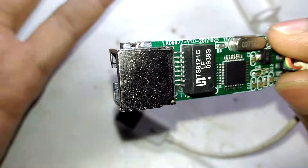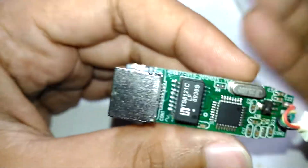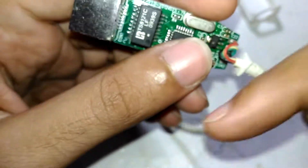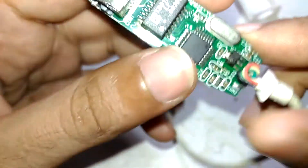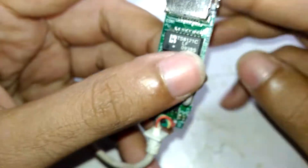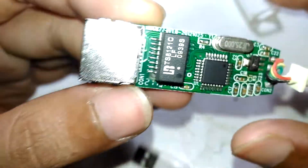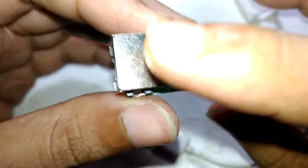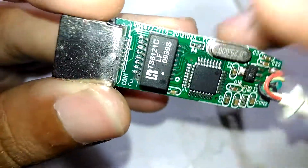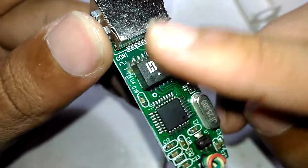Whenever you hear 'isolation transformer,' what comes to your mind is probably the AC isolation transformer used to isolate AC mains from the rest of a device — I made a video about that too. What this thing does is isolate the LAN port physically from the rest of the circuitry. It passes all the signals, but there is no physical connection between the LAN side and the other side. If you measure continuity between the two sides you get nothing.